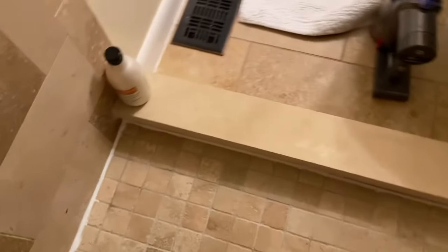You've got to be really careful to get these corners sealed. There are spots where I got too much caulk because I had the angle wrong, but all in all it's a decent job and it's going to work. It's going to keep the tile waterproof, which is the important part. Now you want to wait at least 24 hours for the caulk to cure before putting water on it — air on the side of caution. I'm going to go two days before we take a shower in here.